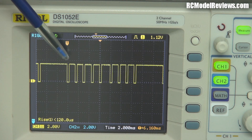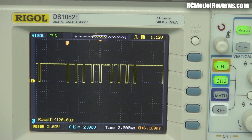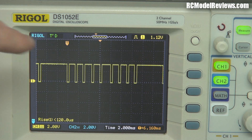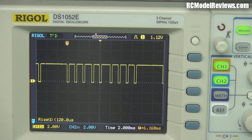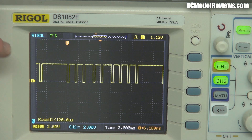What this basically means is we have the sync pulse, all the other pulses have to fit in there, and then another sync pulse. That poses a bit of a problem because sometimes if you've got eight channels, something rather interesting happens. When I move the sticks you'll notice the first pulse after the sync pulse gets narrower and wider, but you also notice the sync pulse itself changes length because there's not enough room.